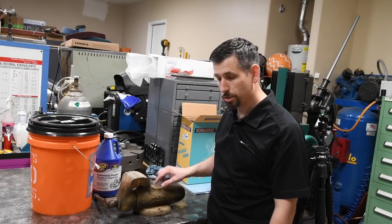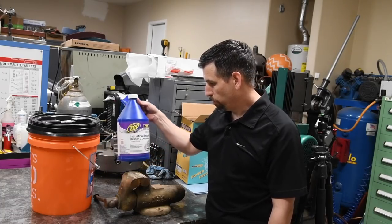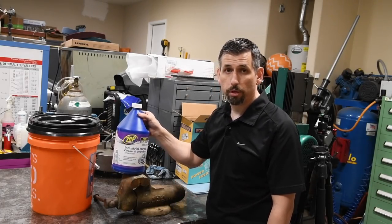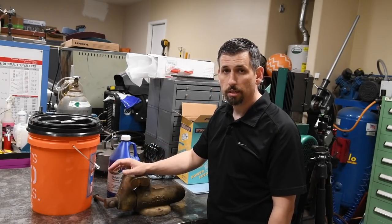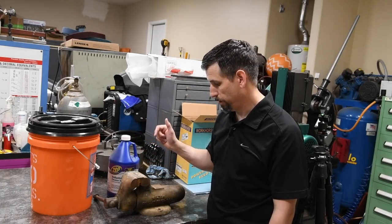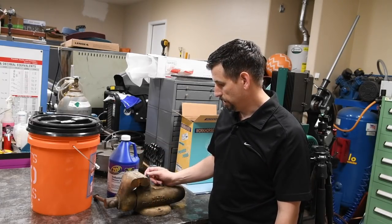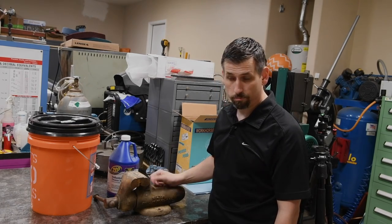So the first thing we're gonna do is just degrease this thing. My potion of choice is a bucket of warm water and then industrial purple cleaner degreaser concentrate. This stuff works wonders on even removing paint. If you put a high concentration of this stuff and put some parts in there that are painted and greasy, you can get them like they came out sandblasted almost. It can be pretty impressive with the result. So the first thing we need to do is disassemble this guy just into two parts and then fill up the bucket with some of the concentrate and just let it sit.